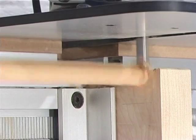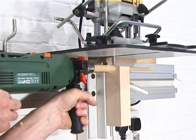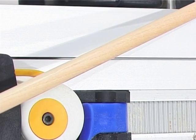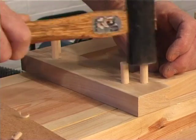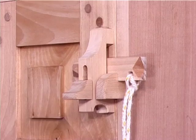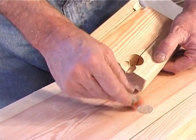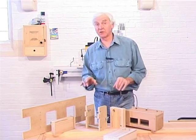The same hole, cut with the same cutter in a block of wood, can be put to service as a dowel pop. Any cutter placed exactly over the opening will make dowels any size and of any wood, so you're never stuck for a doweling that suits the type of wood you're using. Look, this was used to fill the bolt holes on my workbench, all done the same way. You can see that a very few simply made accessories and add-ons can greatly extend the use of the Woodrat.